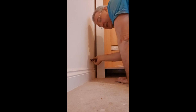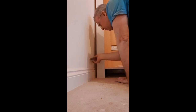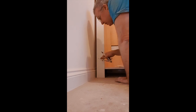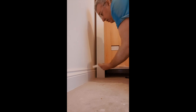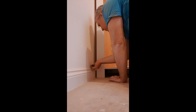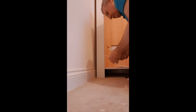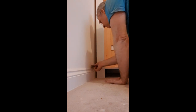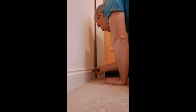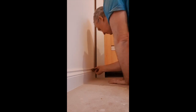If you bring the compass here, it relies on it being absolutely at right angles, perpendicular to the surface you're scribing from. I'll exaggerate, but as you come down, if you twist that and waggle it, you'll end up with a line that isn't true to the line that you're trying to scribe to. The offcut is foolproof. Trust me, I'm a bedroom fitter. So if you use it the right way around. Okay, so I now set the compass to the line that we've marked with the block. And then, keeping it level, mark the shape. And again, if you don't keep it dead level, you don't get the right shape.